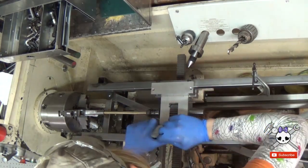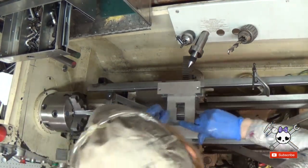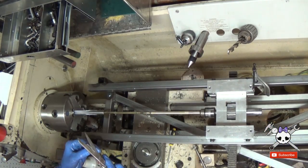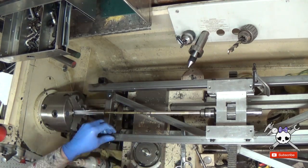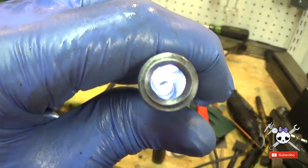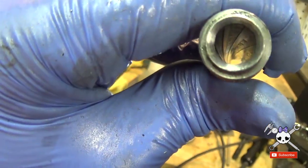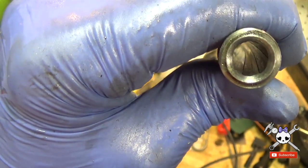I'm also going to make a proper cutter. The cutter I made here was sort of proof of concept — this style is the type they used to do muskets with. A modern cutter would have a hinge and a ramp built into it so you don't have to use the little paper shims, and you can control the depth of cut much better that way. Cutting the barrel took me about an hour. Overall the rifling came out really well. Down in the grooves it's a little rough, so I think I'm going to lead lap it to smooth it out. I have an old Mauser 98 that has rifling worse than this and it shoots fine. Overall, it wasn't too bad for rifling my first barrel.